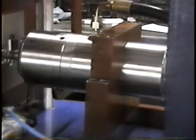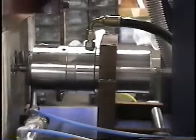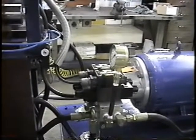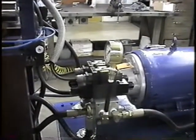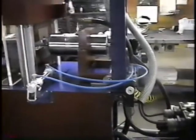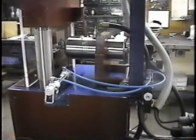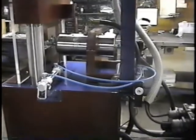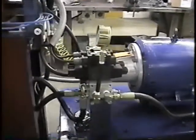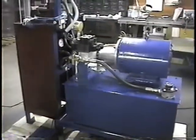This is the RCP hydraulic cylinder, manufactured exclusively by AMH and used for many different types of operations. The form cycle with the RCP is done with hydraulic pressure. We use a hydraulic cylinder to clamp the tube with about 15 tons of clamping pressure. When we form, those clamps will not open because they're held with the PO check valve. Here are the hydraulic solenoid valves. There's sufficient oil in the system to run large quantities of production without any problem with overheating.